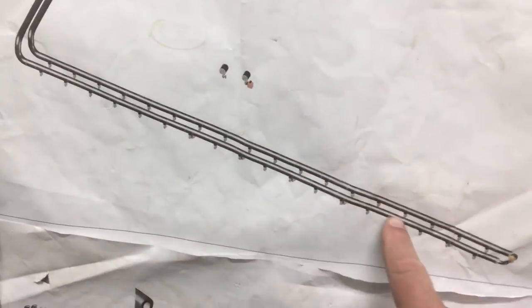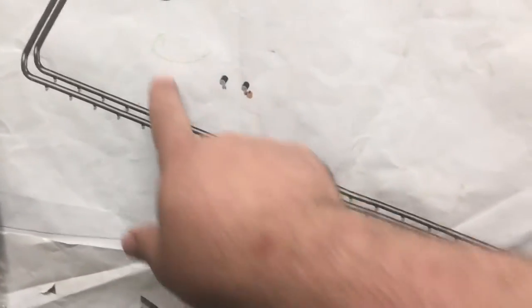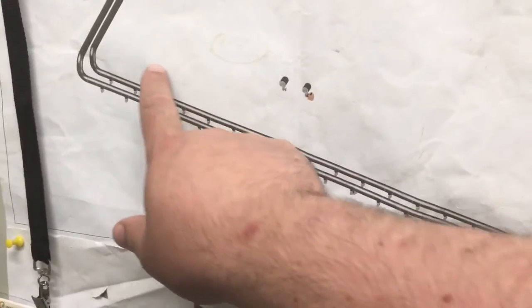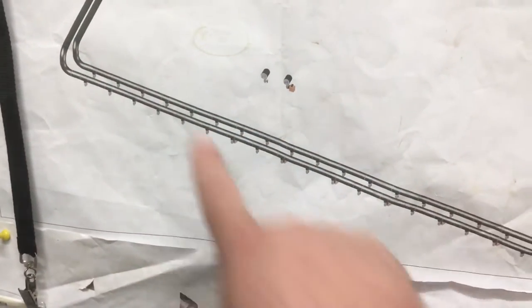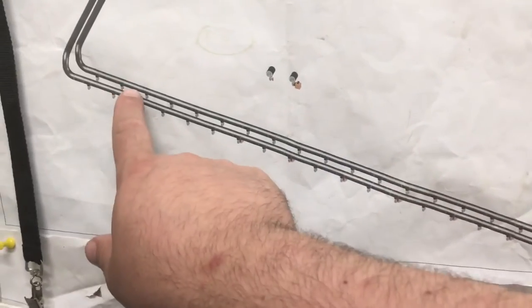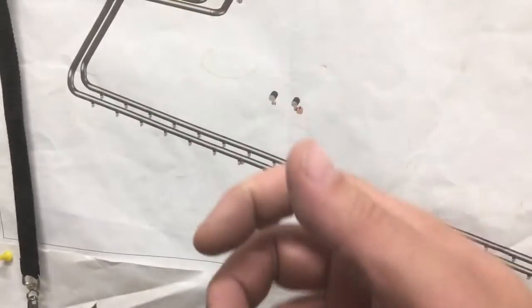Video 2 is going to be a little bit more in-depth in conversation. This drawing sucks on camera so I'll send you the actual PDF. I've got the DWGs if you want them. This is how I knew how many valves to add in my headers — I have 18 tanks that will fit in that fermenter hall. That's the maximum ever. So it's really cheap to add these valves now because you just open a valve later when a tank is online.